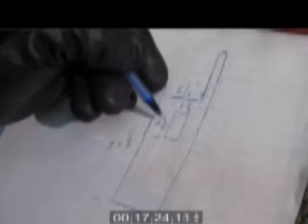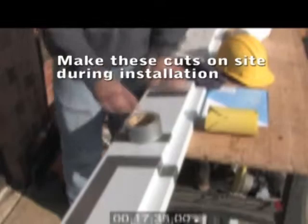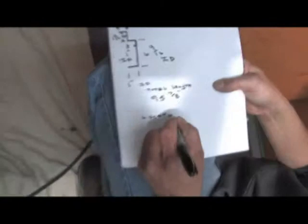It's better to take some measurements once you know exactly how the cladding is going to sit. For now, we're not going to worry about measuring to notch the strike jamb to fit around the transom — we'll just take the measurement all the way to the top. We're also not going to worry about the location of the lanterns; we'll take care of them once we have something solid to work with.